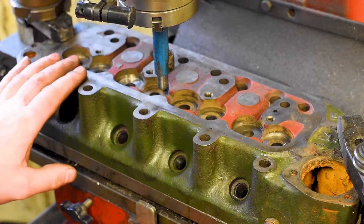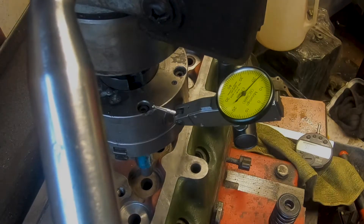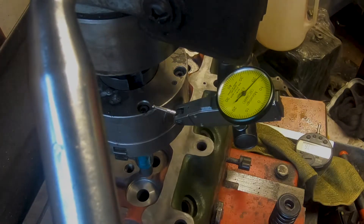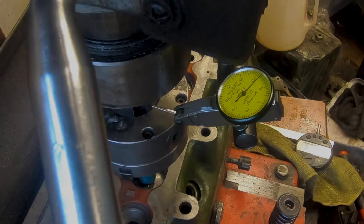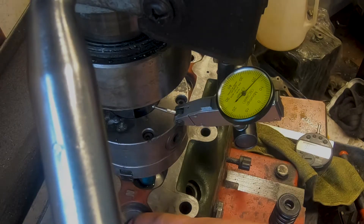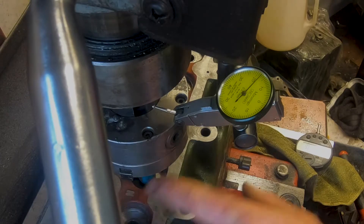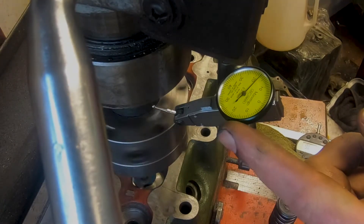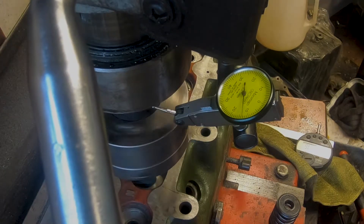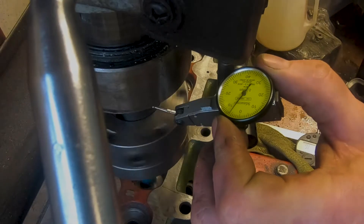So I have a zero now. I'm going to show you how I set the zero up on the dial indicator gauge on the milling machine — it's pretty straightforward. We bring the milling cutter back over by wheeling the carriage over. Just before we put this cutter into the cylinder head, I like to put a little dab of oil on the pilot, as the pilot is running in what is the valve guide boss. We then start the machine, watch the dial indicator, and bring it down until it just starts to cut on this cylinder head. As it comes up to cutting, we can set that as our zero.